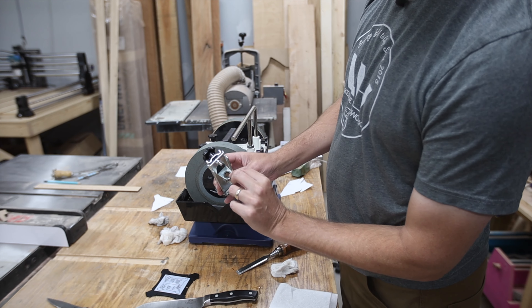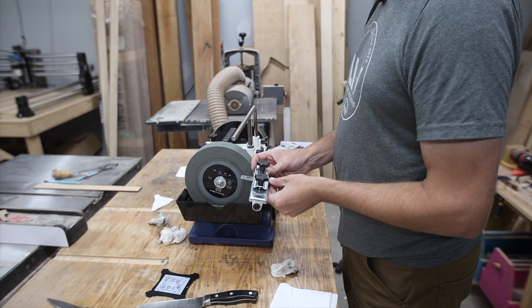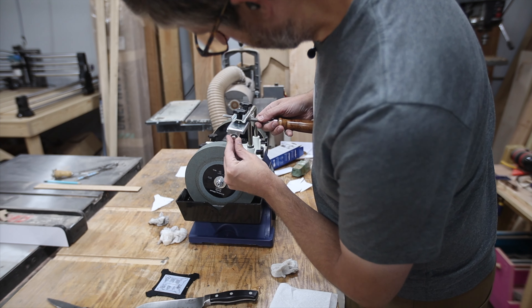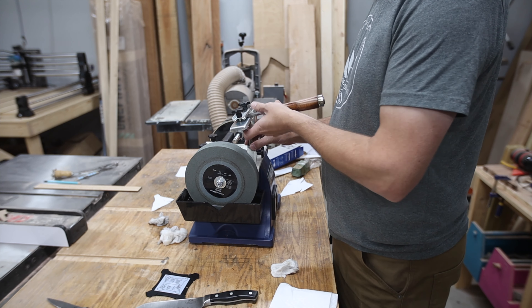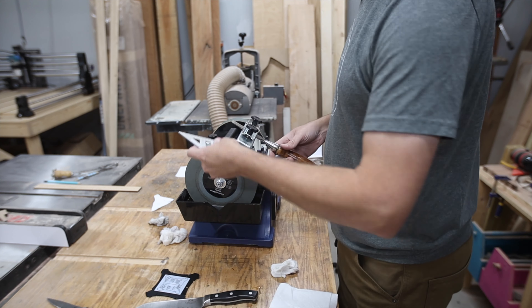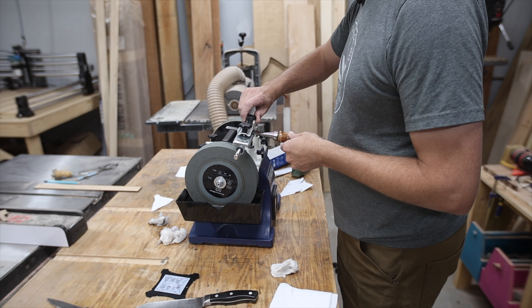A few things to note: you need these spacers — do not get rid of them. Put your chisel in the jig, get it set how you think it looks right, tighten it a little bit and put it on the bar. I found that even when I used a square to check it, the wheel doesn't look perfectly square to the tool. You can come out with a slight angle, but that doesn't really matter because if you hand sharpen them they could do that anyway.